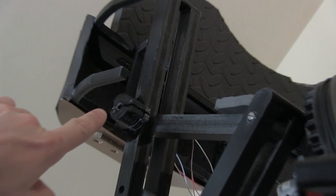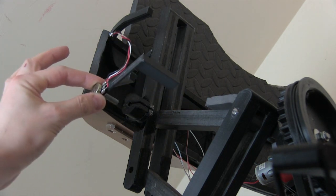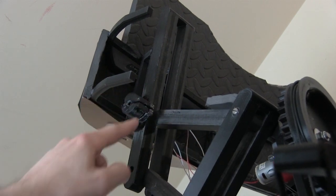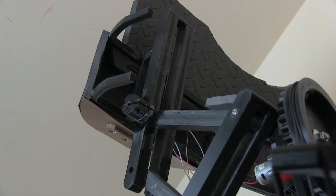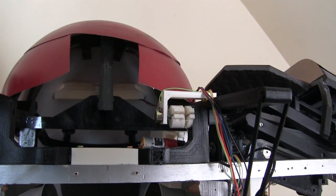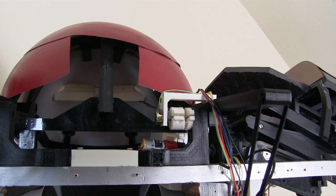I've made a kind of hub here which goes right over the joint — it's got a split in it and a hole in the ends, and in that hole I'm going to insert a potentiometer. On the end of that is a lever, so once inserted this lever will solvent weld onto this piece, and then I can use it to measure the angle of these two joints. That's how I know where it is, and that means I can do things like slow down as I get to the target position and accurately tune how much it opens and closes, instead of just using end switches. This is very similar to the thing I did in the rest of the head mechanism — I already wired in and tested that one. But first we need to remove all of the old electronics, get the new control system in, and then we can try controlling these things over Bluetooth.